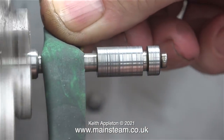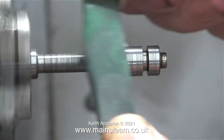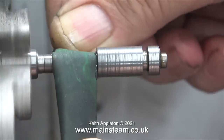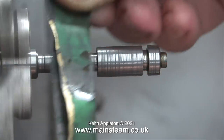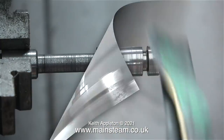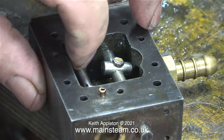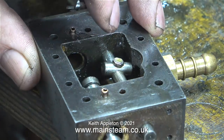After three or four minutes with the wet and dry sandpaper the piston is now a very slightly smaller diameter. If this doesn't work I will make a new shuttle piston. I've turned it round in the chuck to do the other end, and you'll notice there is only one groove for an o-ring at this end, not two like on the other end. Previously, even without the o-rings, this shuttle piston was quite a tight fit in the cylinder. Now it feels a lot smoother.